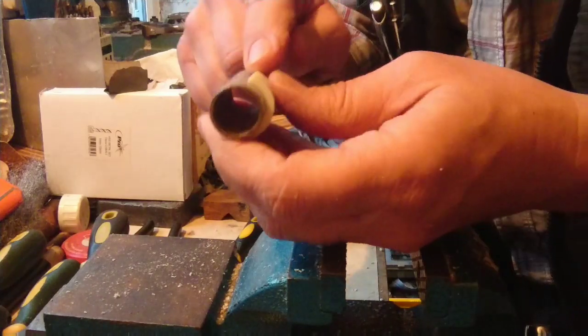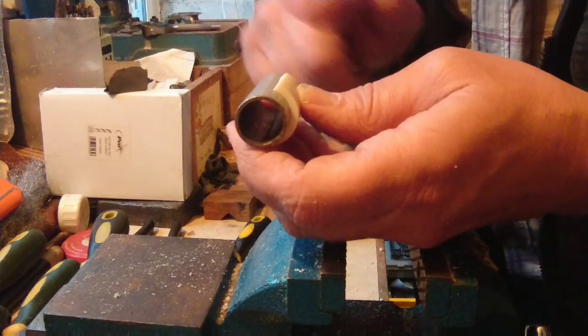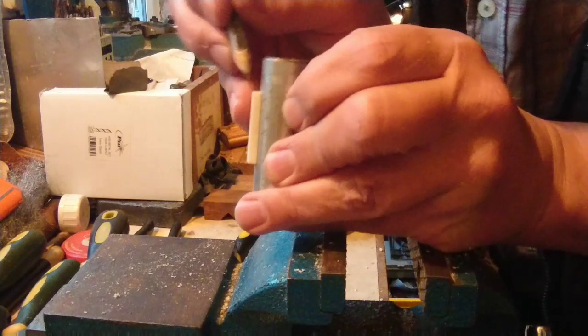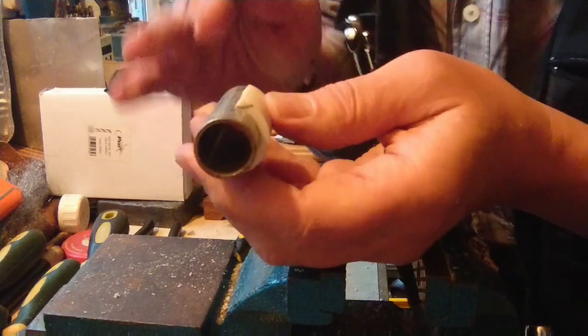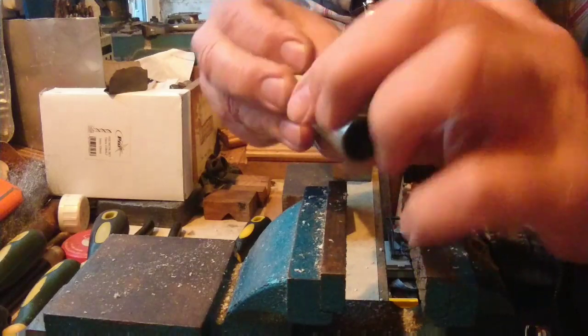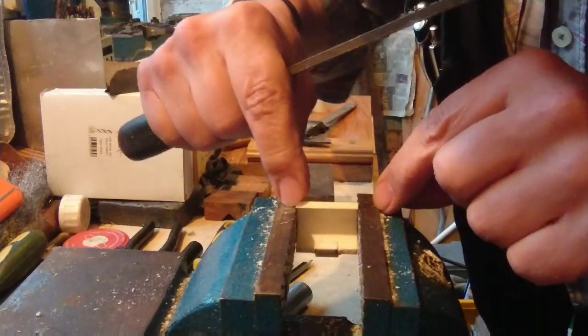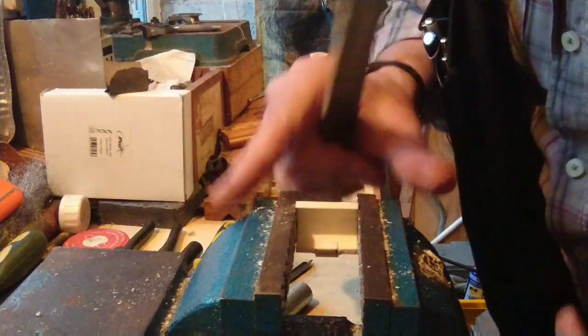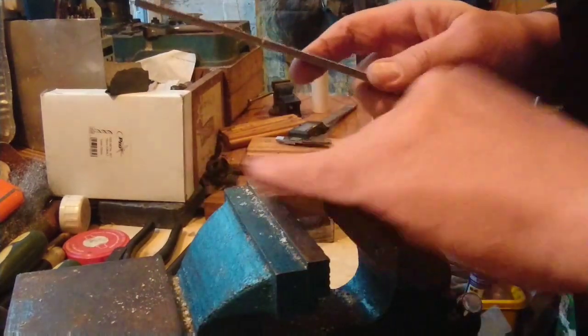What I'm going to do now is shape this. The chamfer at the top side is not going to be enough to clear where the C key comes down onto the C sharp chimney, which is the one most likely to be interfered with. So I'm going to file that away to be a tangent to the tube. I'll do that with a file clamped in the vice jaws to get the requisite clearance, and also get rid of all these sharp corners. I've mounted the workpiece in the vice with just the points where it was sawn off level with the jaws, clamped quite hard — I can use the surface of the vice jaws as a guideline for filing flat at the angle I want.